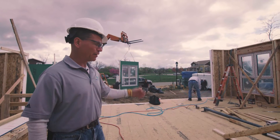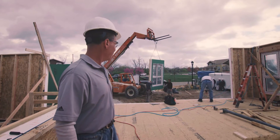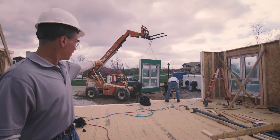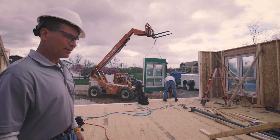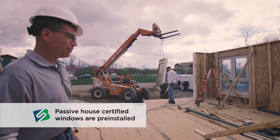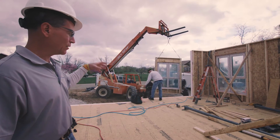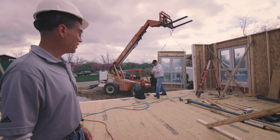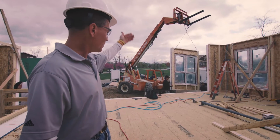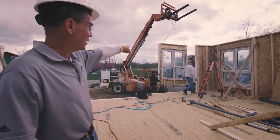We're here on site with the BuildSmart product — specifically one of the BuildSmart wall panels. In this case it's a panel constructed with structural engineered stud framing, an OSB airtight layer, a pre-installed airtight passive house certified window, an EPS foam insulative layer, and the exterior zip wall layer. It's all complete as one system, including the structural framing, structural sheathing serving as the air barrier, EPS insulation, and exterior zip water-resistant barrier.